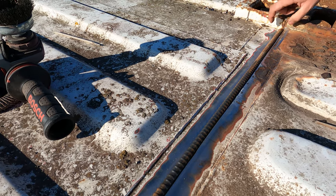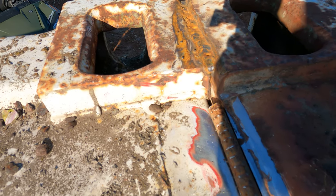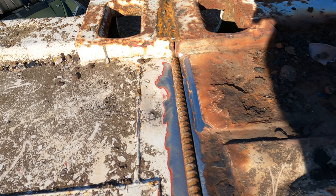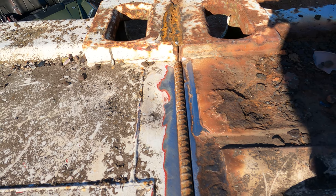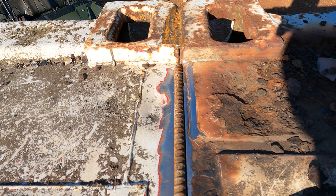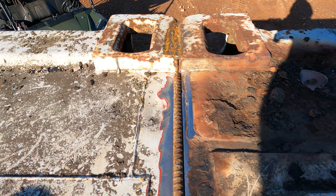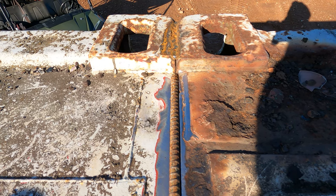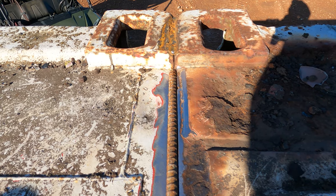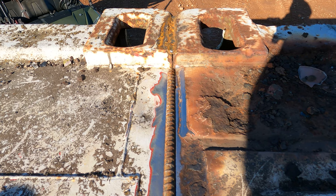It's going to be a little tricky over here on the corner where this rebar ends — there's paint and stuff in there and I couldn't really get in with my wire wheel. So that's going to be a little bit tricky; I'm not sure what I'm going to do there. It may just be a matter of stacking up some welds, wire wheeling it off, and welding some more. Ultimately it's not structural — it's just keeping water from going in. So we're going to slowly start getting things tacked into place, and hopefully by the end of the day we have a full weld down the length of this container, then we can proceed to working on the inside.